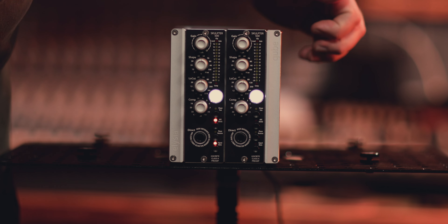What I love about the phantom power is that you have to press and hold it for it to turn on, and as soon as you do that the whole channel strip mutes, which stops any clangs and bangs. After a while it stops flashing and you know that everything is charged up and ready to go, and the channel unmutes. When you want to turn it off you also have to press and hold, which is very intentional. Then we have our mute button, which is a lovely thing to have on a channel strip. However, I think Elysia have over-designed themselves here, because as soon as you plug in a jack to the DI input the channel mutes immediately, and as soon as you turn on phantom power the channel strip mutes immediately. So the mute button doesn't really get used as much as I thought it would, because it automatically engages.